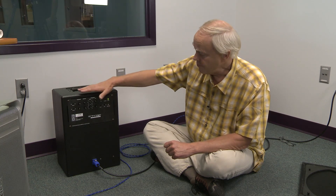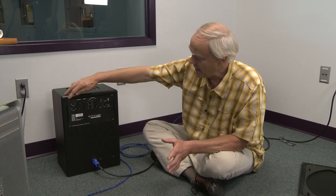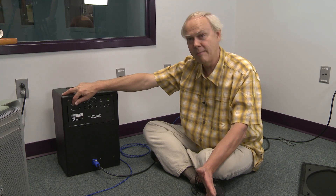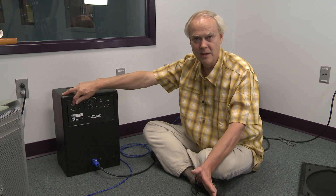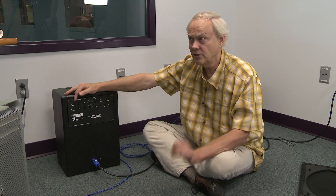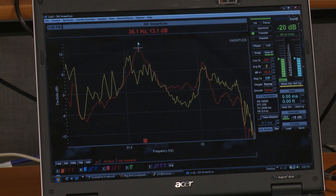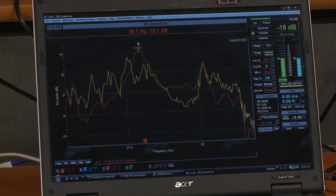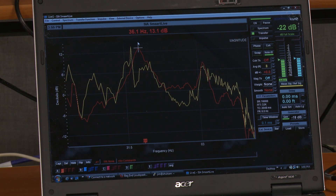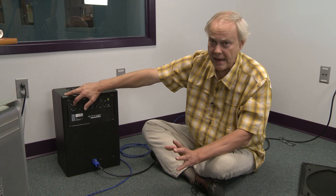I've preset this E-Trap for this mode, which is around 36–37 Hz. It's also unique because the E-Trap is the only bass trap you can A/B — you can't take a big Helmholtz resonator or passive bass trap and switch it on and off; that's more of a construction project. Here we can just turn it on and you can hear the difference and see the difference in a measurement. With eight averages, fairly quickly you can see the resonant peak — the clear mode down at 36 Hz where there's a buildup in energy. This is the first mode of the room, where the most energy is, and it's where you will get the most benefit by applying damping.